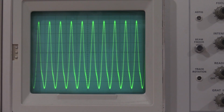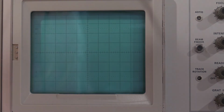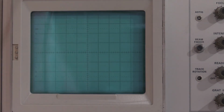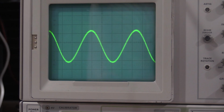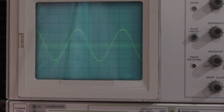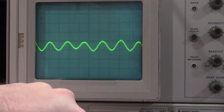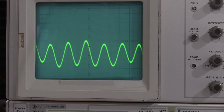Okay, we can grab 10 nanoseconds. See if we can grab 5 nanoseconds, if this is even. Okay, we'll lock in at 5 nanoseconds. And it will lock in at 2 nanoseconds. So the high frequency calibration on the high frequency timing is working just fine. So I just have to check the phase shift now.